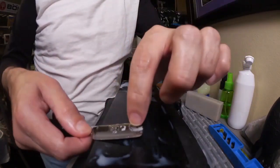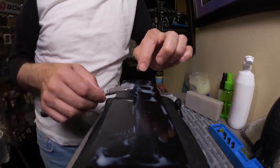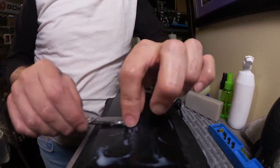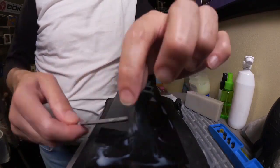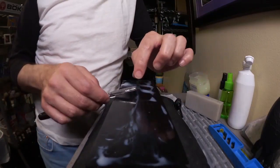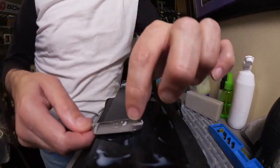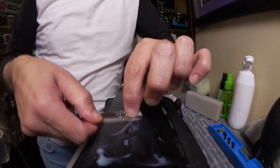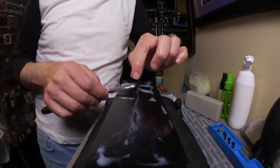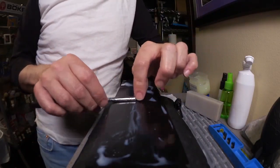So a bevel on a razor like this is about 0.8 of 1 millimeter from the apex toward the spine, and about 1/10 of that zone, perhaps, or maybe 1/20, let's say, will be narrower than 1/10 of a millimeter in thickness. And in that area, if you touch it just right, it bends, and if you slow this down, I have no doubt you can see that bending.